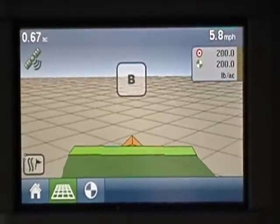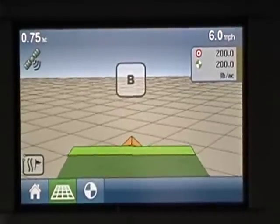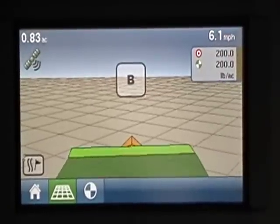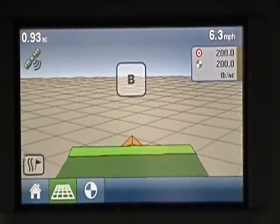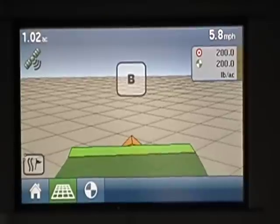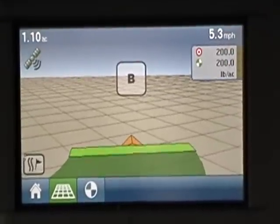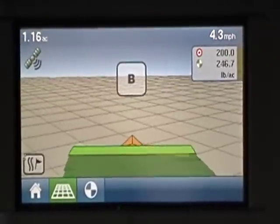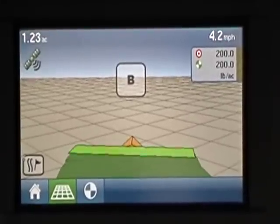All I'm doing is driving down a road here, so I can't really run beside this swath. I'm going to have to come back up this swath. When I get down here, I'm going to go down this hill. I'm going to hit my B, and that's going to give me my A-B. What it's going to do is grid that off — I think I've got my width set on 80 feet, so it's going to grid it off on 80-foot grids. Then I'm going to get off of this line so you can see how it will try to put you back on the line.